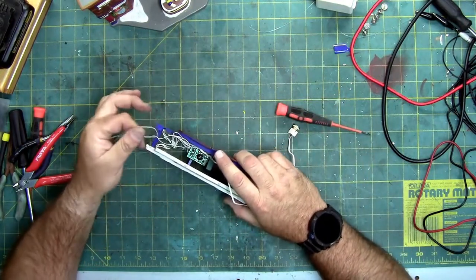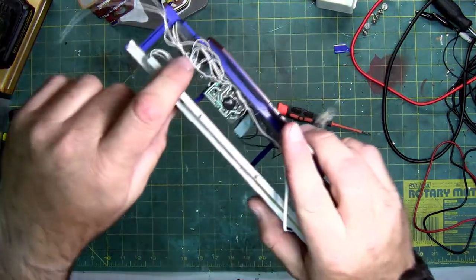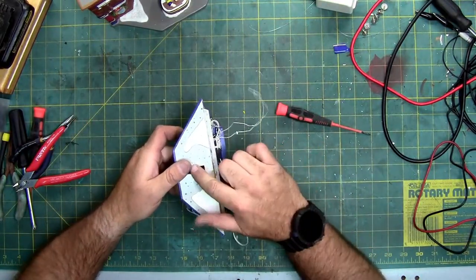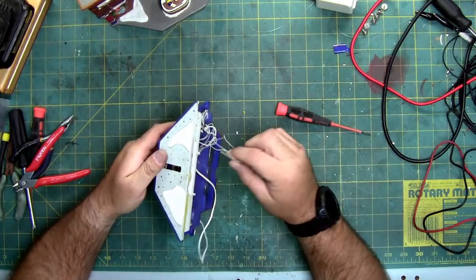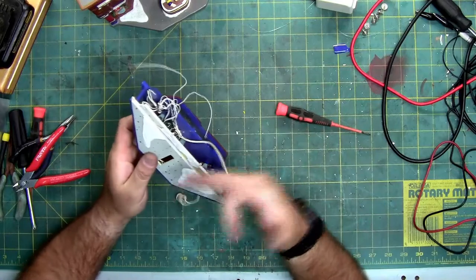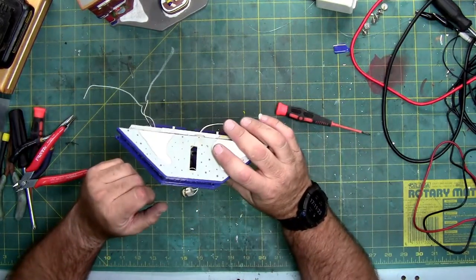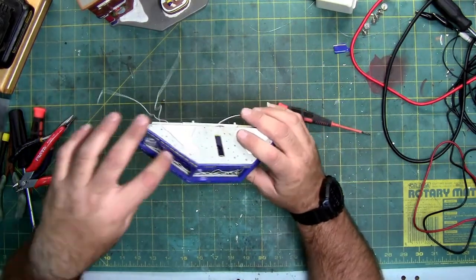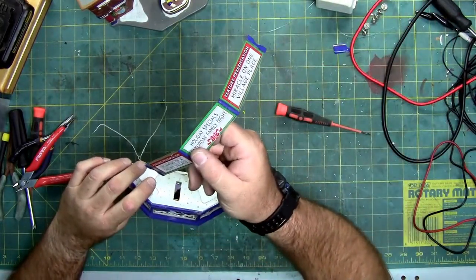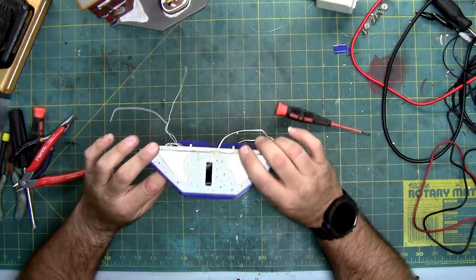So there's a couple ways to fix this now. Now that I've removed the wires from the glue and the knot, instead of extending these wires, I can feed them up through this hole and solder them directly to that sign. There's enough slack. And when I glue the sign in, because this marquee still isn't attached, I can tuck the wires back into the bundle. I believe the reason you do that is neatness, and if any of the wires get in front of this light, it'll cast a shadow on the inside of the actual marquee. So we don't want to cast any shadow, so we need to keep it behind this bulb.